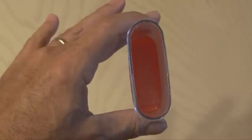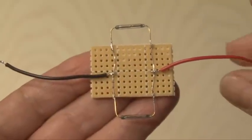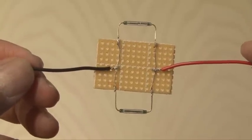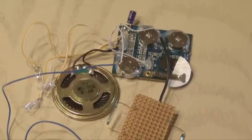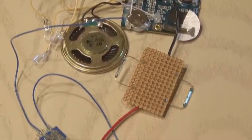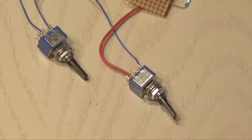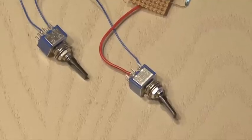In the project, a small perfboard was used to attach the magnetic reed switches to, so that's what I built. Your card may vary in what you do regarding the circuit in this project, so it'll really depend on your card. I've wired in the magnetic reed switch assembly along with two additional three-way switches to the optional little switch we found on the greeting card.